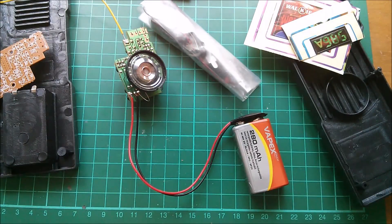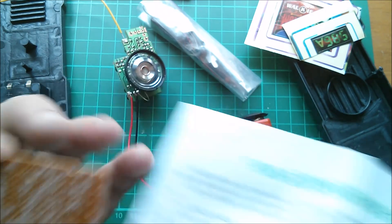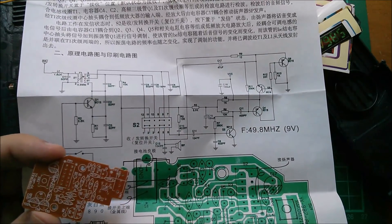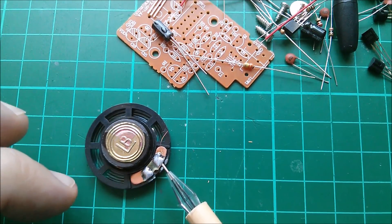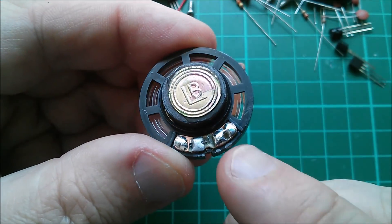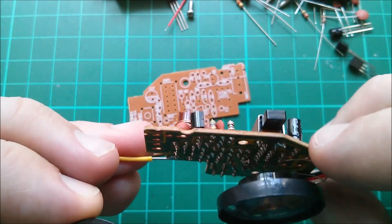Okay, so on the board it looks like a lot of the resistors are standing up, not laying down, so it doesn't really make much sense to put low-lying components on first. I am going to have to completely cross-reference all of the components because they're only marked as C1, R1 with their values on the schematic. Let's get going. Oh dear, this is bad — the speaker had a bit of wire dangling off it, so I started pulling on it and it's not really soldered down properly to this pad here. So I'm going to have to re-solder that before I lose that piece of wire altogether. Right, I think I've fixed that, so hopefully that has survived — that can be soldered on, similarly to the way I've done this one, just put a couple of wires down onto pads on the board.